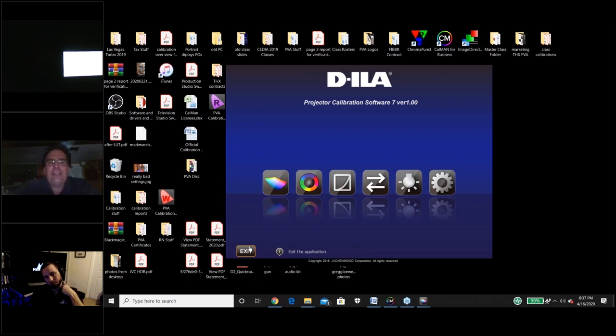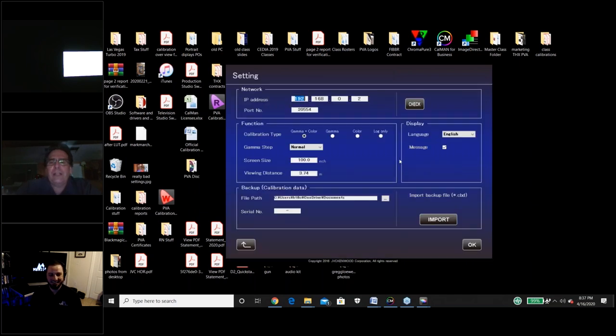Right, and it's in different markets too. I think JVC is probably doing something in the North American market and the European market that they're not doing to the Asian market. I don't know. On some of the Asian projectors, when I'm teaching classes in Thailand or Taiwan, the gammas are very S-shaped and all kinds of weird things, that the only way you can correct them is with the software. Good to know. And I think the U.S. guys are anal retentive enough on video fidelity to maybe fix this when it gets off the ships.